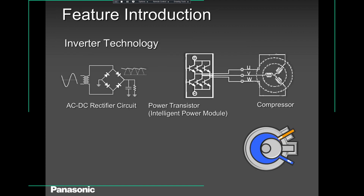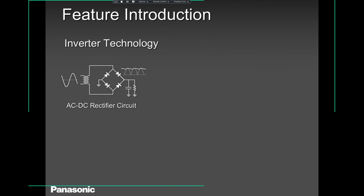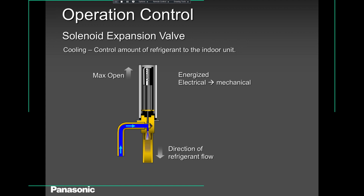So I gave you a very basic understanding of how this electronic expansion valve works. So you have an idea of what happens when you don't have enough flow, when you have less flow, or when the system is going into pump down. You're turning on the unit and the unit is going into pump down. Your valves are fully open, but you don't understand what happened. Chances are this guy here is clogged. So just keep that in mind, okay?